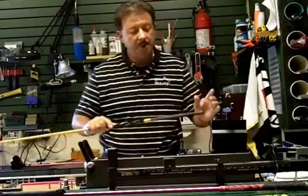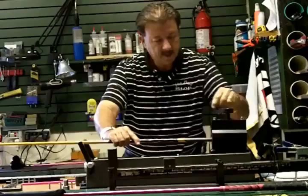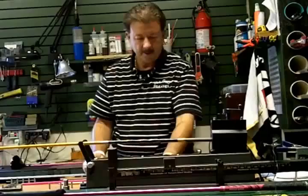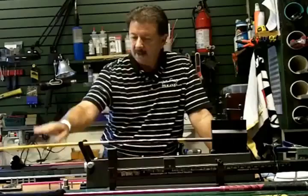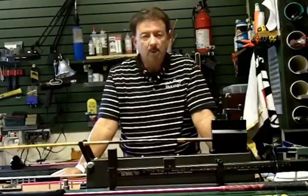Now I've got the shafts marked. I'm going to take them, put them in the frequency analyzer, and clamp them down. The first measurement I'm going to read is at 41 inches. I'll take a one-pound weight and put it on the tip end of the driver, turn the analyzer on, let it set, reset it, twang it, let it come up, and mark down all the readings, then compare the two shafts.